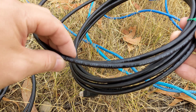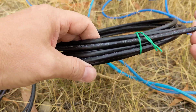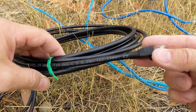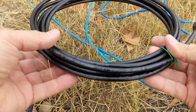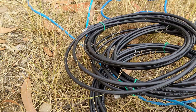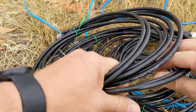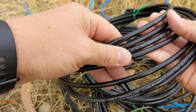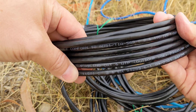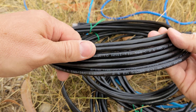Instead, use outdoor rated cables. You can see right here it says 'outdoor use.' This is Cat6 outdoor use cable conforming to standards ANSI/TIA and ISO/IEC 11801 — I'm assuming that's the outdoor rated standard. The good thing about standards is there are so many to choose from! I got four of these five-meter cables to connect all the devices. Now, with outdoor cables, there are also direct bury cables for putting in the ground — don't use these unless they're in conduit. If you don't want to use conduit like a PVC pipe, you need direct bury rated cables — that's a different standard.